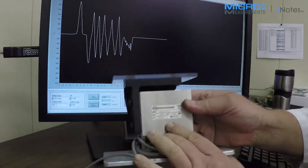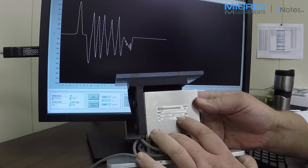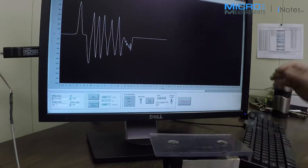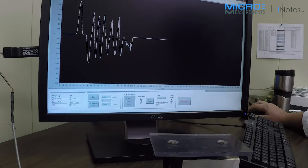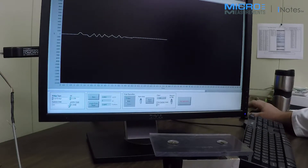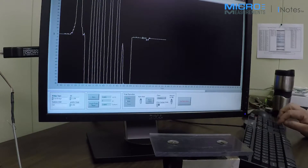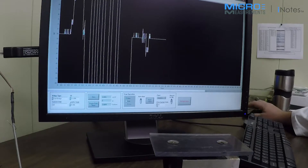Calibration information is published on most load cells with a datasheet. In this case, this is 1.806 millivolts per volt — actually, per pound force it would be 0.1806, since it has a full scale of 10 pounds. So with that connected, we're going to select our custom units in software. I'm going to enter a full scale range of 10 pounds, zero our load cell, and begin scanning.